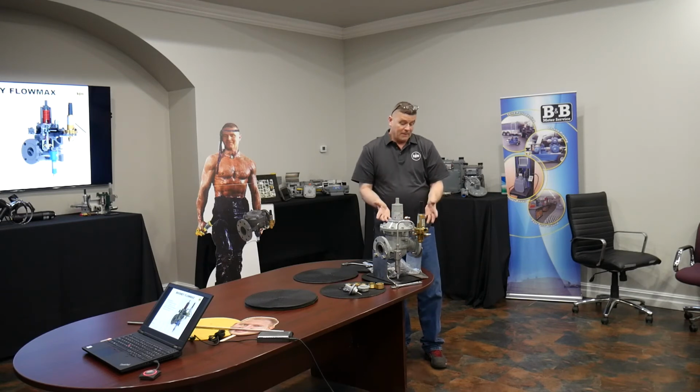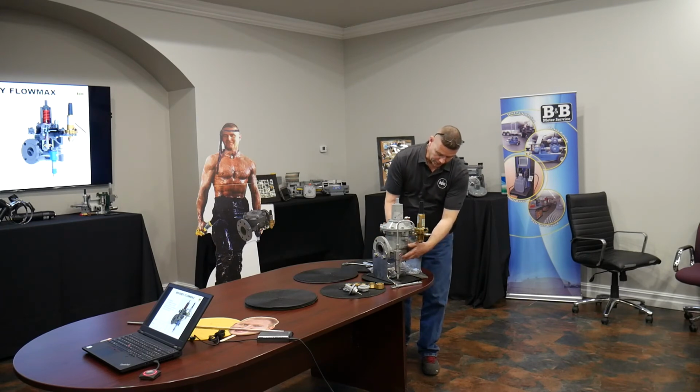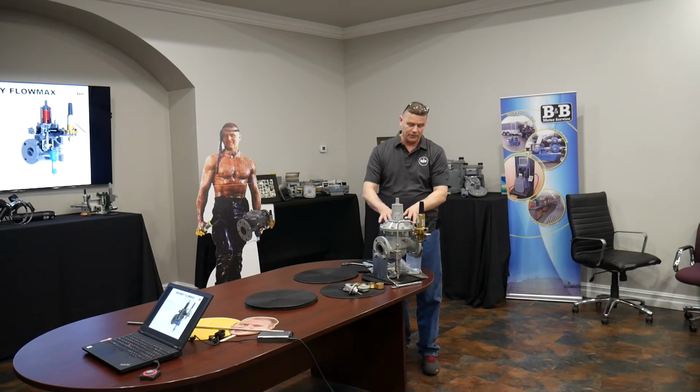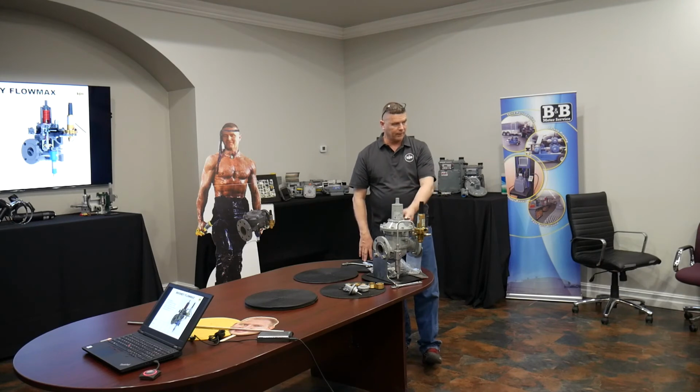Because one of the benefits of this is, this chamber where the actual gas flow is occurring is isolated from what's happening under and above the diaphragm. So there's no way that what's happening up here with the pilot lifting the valve and the equalization to try to close can interact with or leak to what's happening below it, unless the O-rings on the stem have failed.